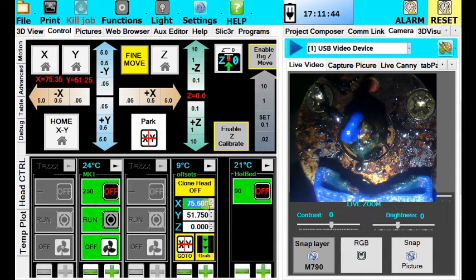Take these values and put them into your head. In this case I've already actually programmed an offset into my head, but normally you will come out with zero, zero, zero, so you simply want to insert these offset values you have found into the head.